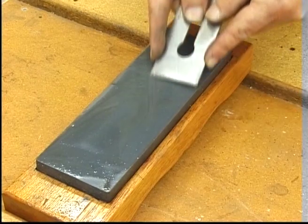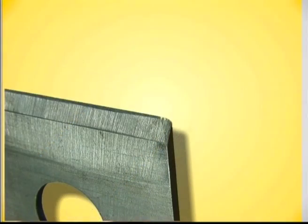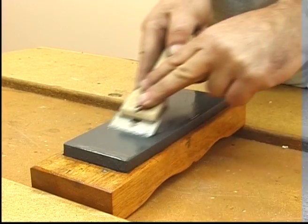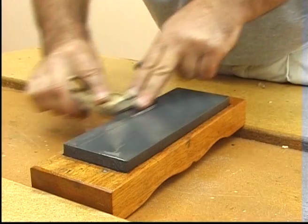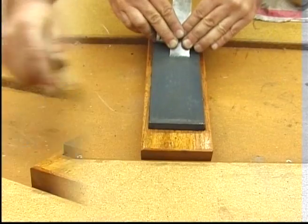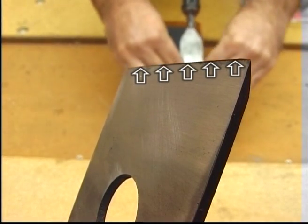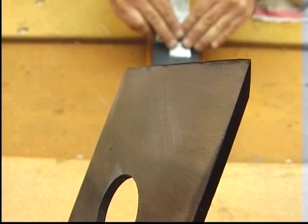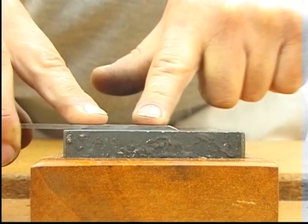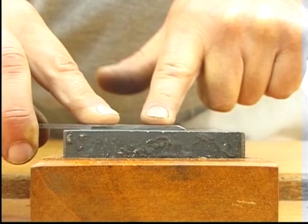The corners of cutting irons from smoothing and trying planes are rounded on the oil stone. Once again, a slotted handle provides a solution for small blades. As sharpening proceeds, a burr or wire edge is produced on the back of the blade. This is removed by turning the blade over and holding the back of the blade perfectly flat and firmly onto the stone.